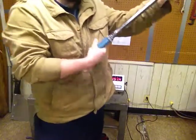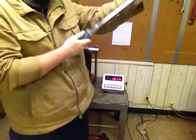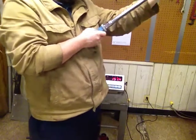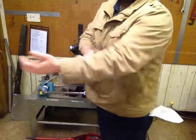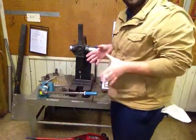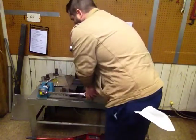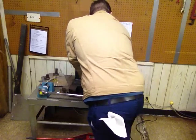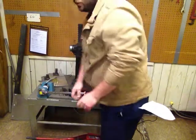Next is full scale at 250. We'll do the same procedure three times and take the average of the readings. The reason we take the average is to eliminate any human error, because I'm pushing until it clicks. If I push too hard or too little, it can affect the reading. Here we go at 250 — 248.8.